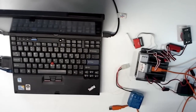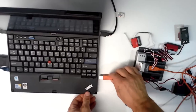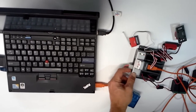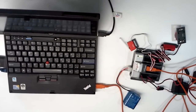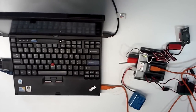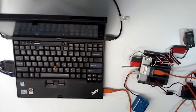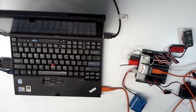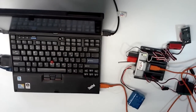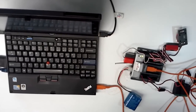Then we're going to plug the battery back in, plug the USB back in, and finally turn on the power again — and we see our two green lights. To make sure that it works, go to the Robot menu, go to Download Firmware, and click Automatically Update VEX Cortex. If it updates or says no updates are available, you know for sure that your VEX Cortex is communicating properly with your computer.